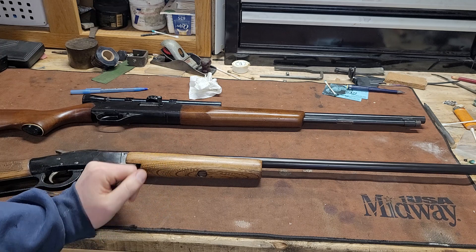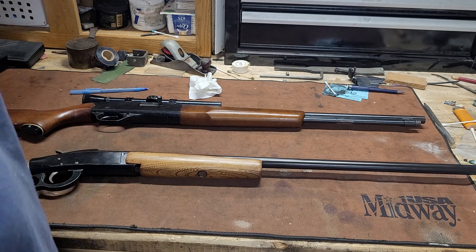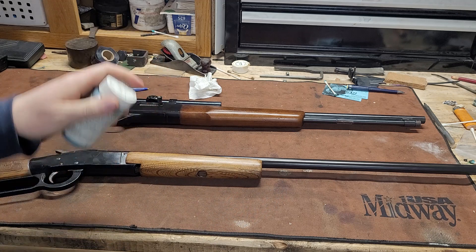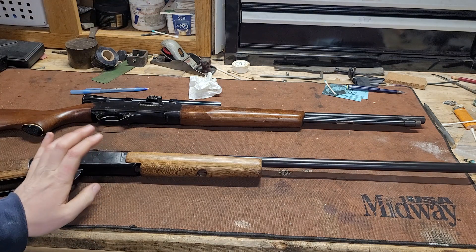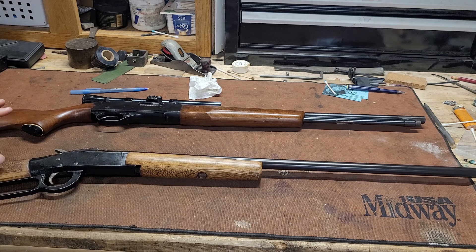These turned out really well. I think a lot of people make the mistake of conflating rust bluing with cold bluing. I've actually had customers argue with me about it, telling me I'm trying to use the cold blue out of a bottle. Cold blue is good for screw heads and scratching things, which fortunately doesn't happen too much here. Rust bluing in my case is an acid-based process — there's a little bit of skill to it and your prep work really does matter a lot.